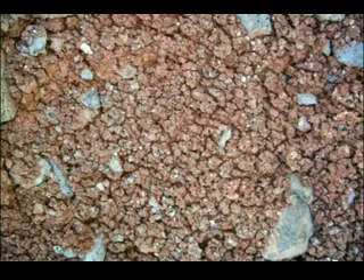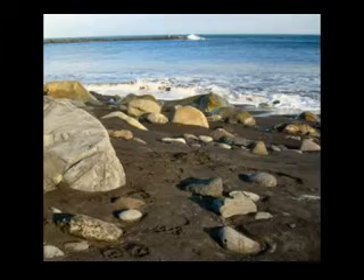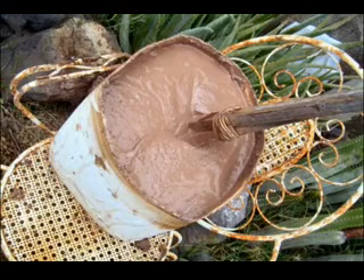Then you have to filter out some stones. But this clay should be mixed with about 40% of volcanic ashes, which cannot shrink. You can also use pyroclastic black sand, which should be collected a little bit from the sea because otherwise it contains some salt. But it doesn't matter. Then you need some barrel or pot to mix it all up with a stirrer.